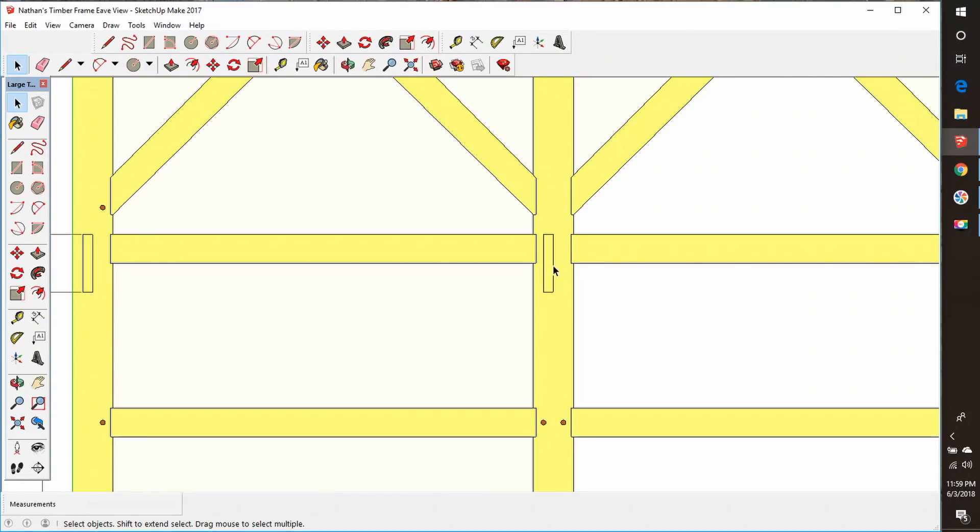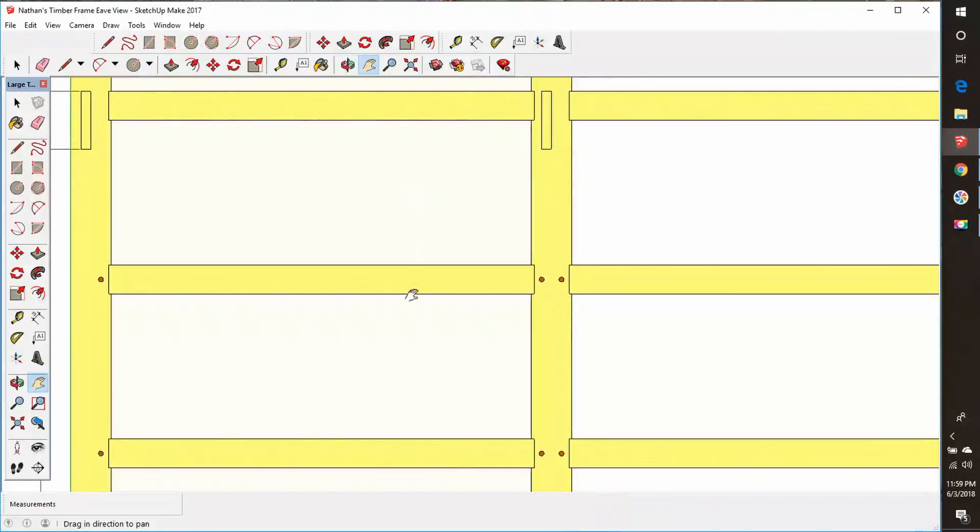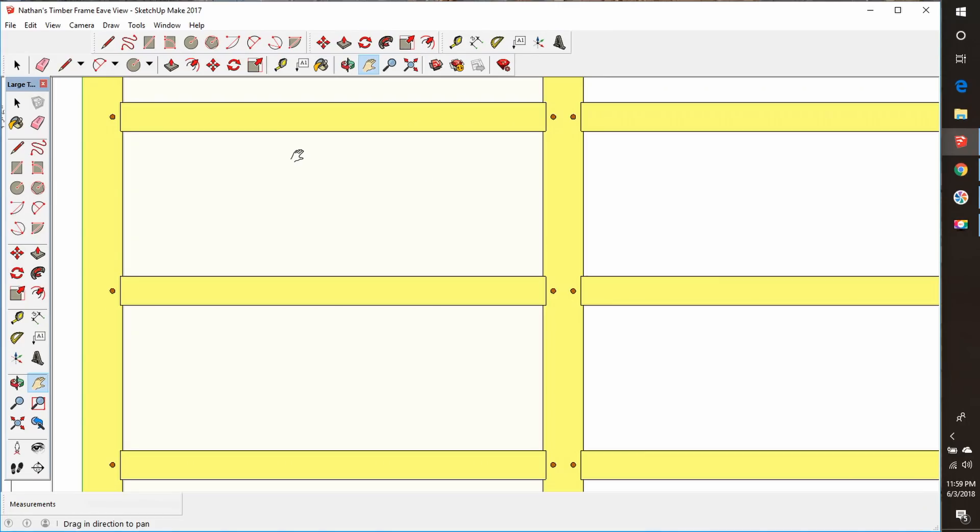You're only going to build these things once, hopefully. If you do it right, it should be a one-time deal, so make sure you take the time to get the right materials and the right sizes. On my own frame, I line these up so the flooring can catch the top of them as a nailer. I timber-locked these into my frame — put them in a housing and timber-locked them. For the girts lower down, the first three coming up from the bottom are going to have 3-inch tenons all the way through so you can peg those. It's going to be a 2-by-3 tenon. I come in an inch and a half and try to hit that tenon in the middle, and I come up 3 inches on these and try to hit them in the middle.